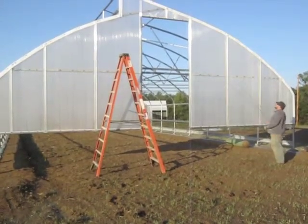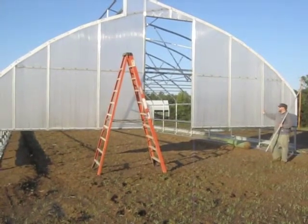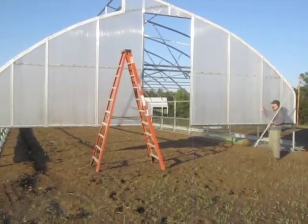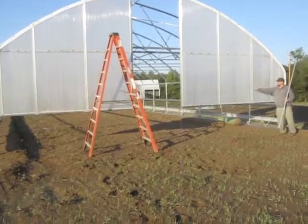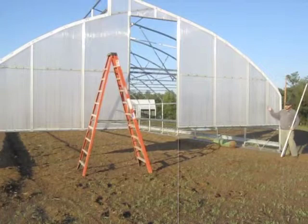After the first sheet was on, we then lined up our double H channel on our next vertical stud. We trimmed this piece to fit. Again, we put our factory edge into our first channel that was already up. We put our double H channel onto this piece before we put it up as one piece, and screwed it in. Came over here. In this scenario, we had about 5 feet from our edge here all the way to our outside, but there's no vertical studs.